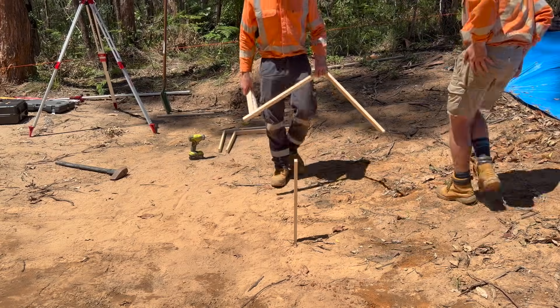You can take this further — for example, we've got a seven meter by twelve meter building. Instead of doing 3-4-5, you can double the three and the four to get six and eight, and then your diagonal should be ten. So measure six meters on one side, eight meters on the other, and your diagonal should be ten meters. This is more accurate than the basic 3-4-5 method because you're measuring further along and checking a longer diagonal.